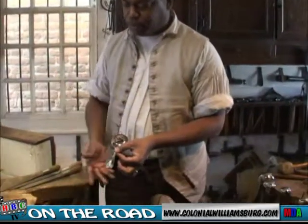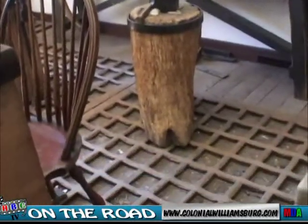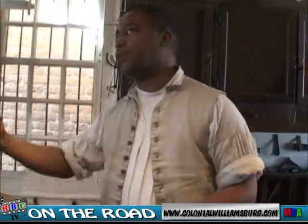So if you can imagine, any filings or silver bits or pieces, it all adds up, right? If you notice the floor out in front with the squares, most of our removing of the silver is done out there, and that's why it's made like that, to catch it, and then you can walk above the silver. Later on, we'll lift the grate, sweep it up, screen it, wash it, and burn it, and use it over again. That adds up to a lot.